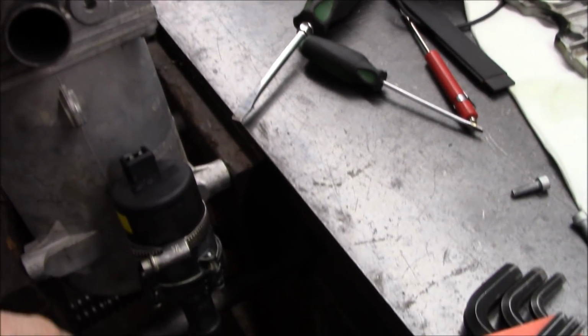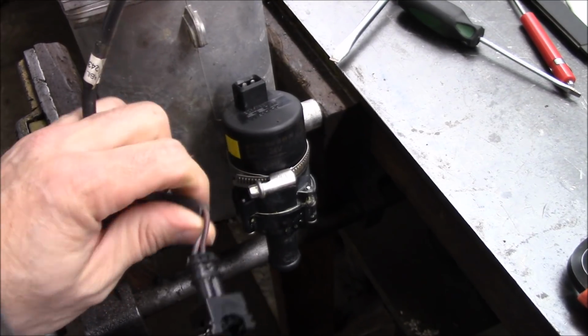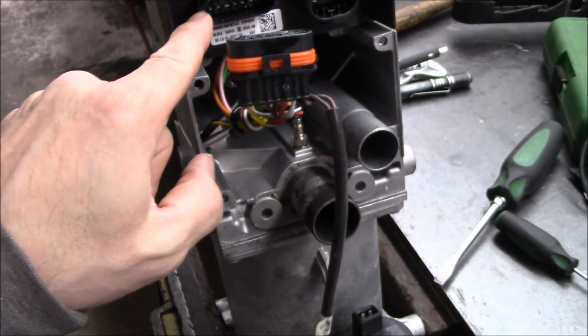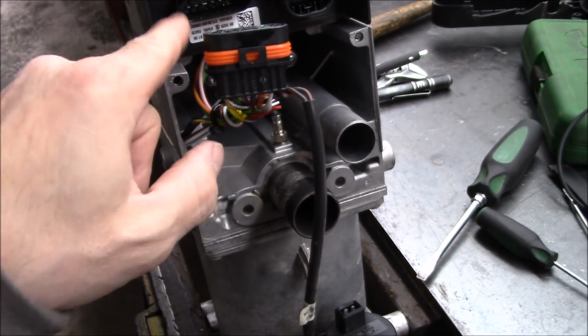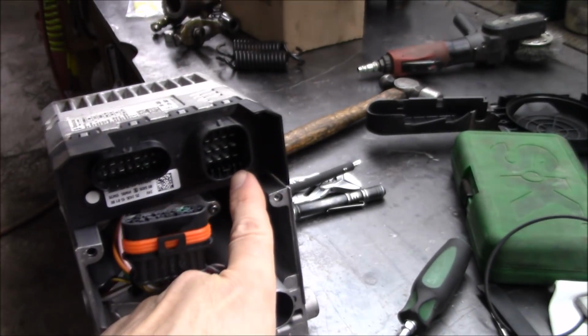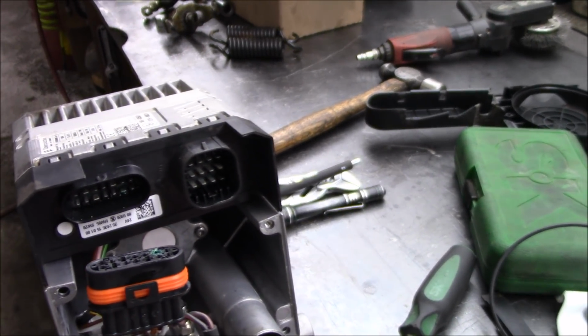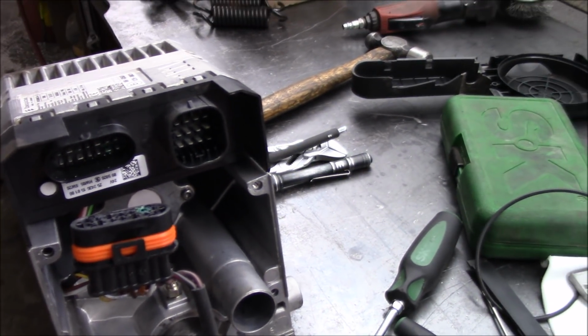I think my theory is right that from the coolant pump, she wicked up through that wire right into this plug, which is in the ECU, the output. This is the outputs to all of these things, and this is the main harness going to the machine. And when I opened it up, hey, there's antifreeze in there. Surprise, surprise.